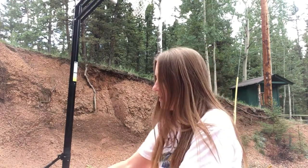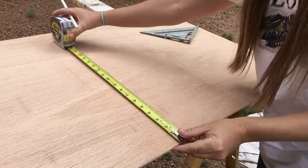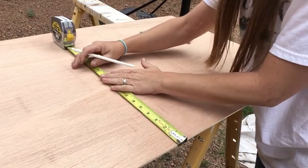I'm going to use a very fine — I think it's 20-tooth — saw blade for my jigsaw, to hopefully not just tear it up as I saw. And I'm going to use a square to make sure my edges are square when I measure out before I make my cuts. Now I'm measuring out the width — mine is eleven and two-sixteenths.